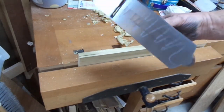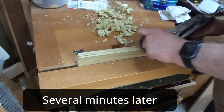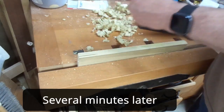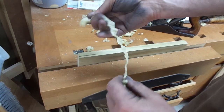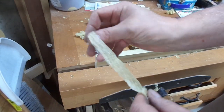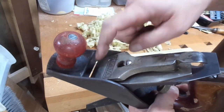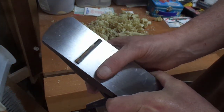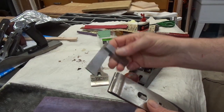The sole is flattened and lightly waxed. I think I finally have the blade flat and sitting where I want it, and that's a very nice shaving — the kind of shavings you like to get when you want them. I took some time to polish the edge at the front of the chip breaker and make sure the lever cap was flat; they both looked to be okay. I had to open the mouth of the plane back to where it kind of started originally. It kept cutting deeper on the right side of the blade, and when I put a square on it, it was ever so slightly longer on the right.